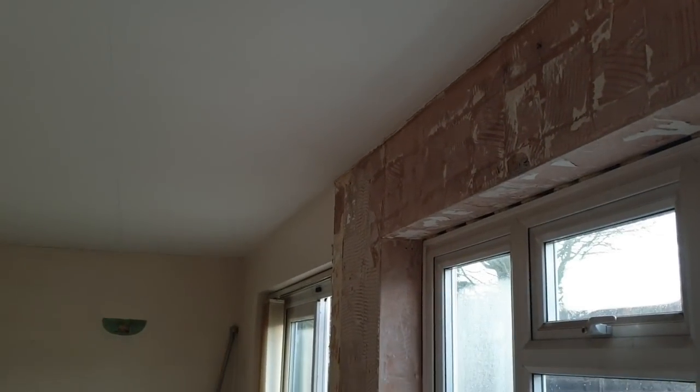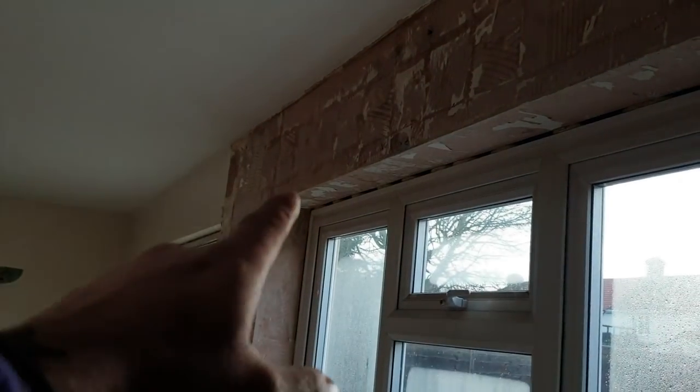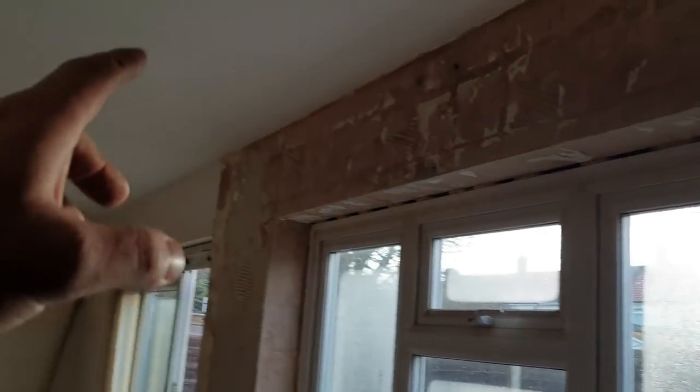All right, so another thing. A lot of people just keep trying to measure off the wall sometimes when they're doing downlights. Downside of that, it's an old wall. If it's not dot and dab, it's been plastered by hand, chances are that's not straight. So even though to the eye, when you're looking at the wall, it doesn't look wonky, when you stand here and you look at your downlights, you will see just how wonky that wall is, because your lights will be like that.